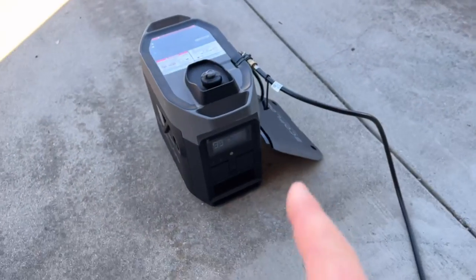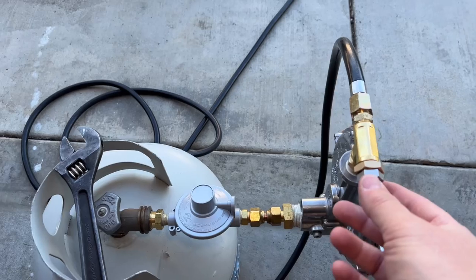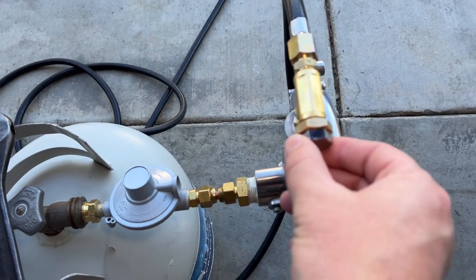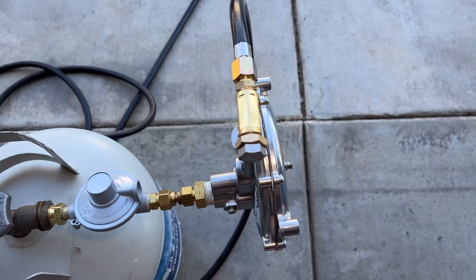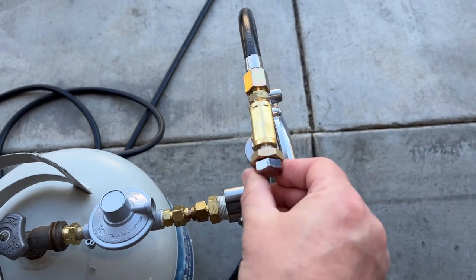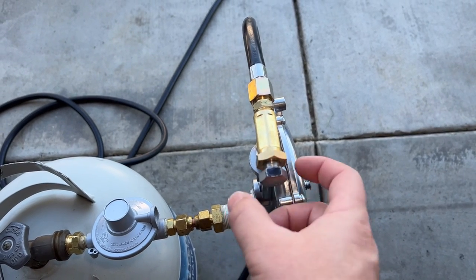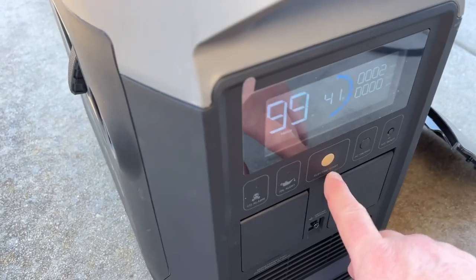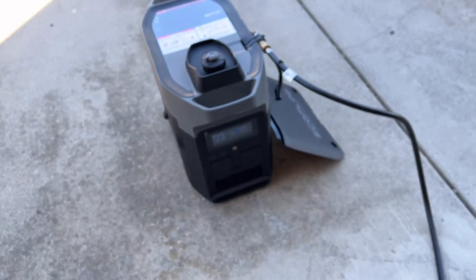Go inside the generator, pop off the panel, and check where the carb is — still not getting anything, so far so good. We're just about ready to fire up the generator. Go to the load block and open it up to about three turns — other generators I've set up have bigger engines at four to five turns. Start with three and see what happens, leaving it slightly snug, then go fire it up.